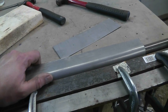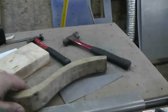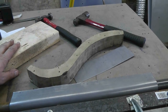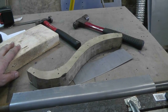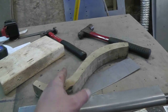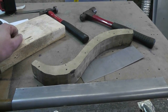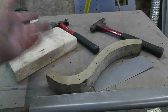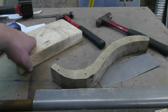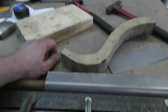So I'll take this out, and along the curve of this - this is how it sits under the car - I'll pie cut it, probably at fairly wide intervals along here, and then up to here I'll have to tighten it up a bit. I was going to sit down and work out the numbers, but actually for this edge it doesn't really matter. I suppose if I pie cut it every half inch it'll be fine, but it's going to probably open up a fair bit on that open edge.